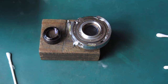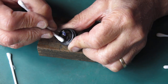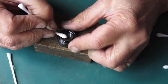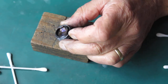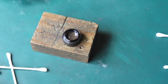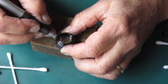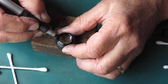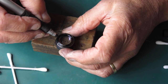I'll do the same to the rear group now. I've just cleaned the body of the lens and now I'm cleaning the glass surface. That looks good. Now there's a chip in the paint on the edge here — I'm going to cover that with a bit of marker pen, because otherwise that could scatter light. It's just in the paint, not in the glass. I'll just blacken that out so there's no transmitted light through there. There's a bit on the other side too — one small chip. That'll do.